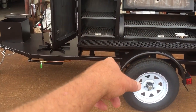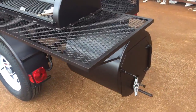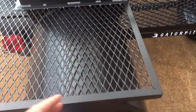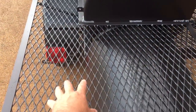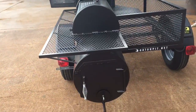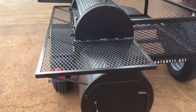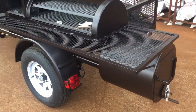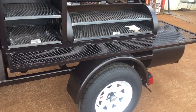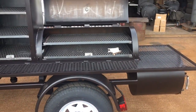It's got a two inch drain down there with a cap on it. You can also add a brass ball valve to it. This customer just has the removable cap. You've got a wrap-around shelf. You can see how the shelf wraps. We do that because you can actually use the heat off the fire box to warm sauce up, or you can set one or two full pans here to actually keep your meat warm from the heat radiating off the firebox, but not so much that it burns. Gator Pit is the one that came up with this wrap-around shelf — my design from 20 something years ago. To my knowledge, nobody's copied that one yet. Why not maximize any heat coming off that fire box and use that heat for something? You can put a full pan of water or a pot of water — just have some cleaning water there.